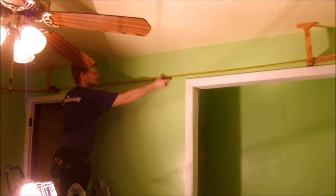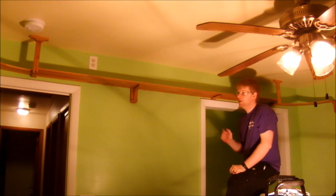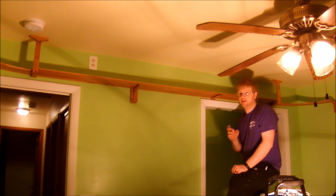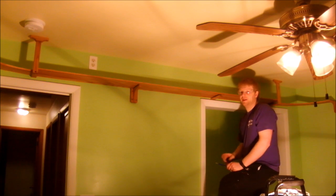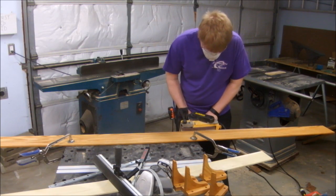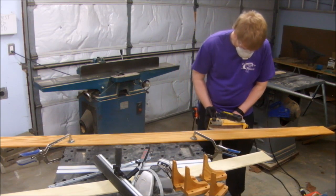Now with my corners in place, I can put my tape measure up and take an actual measurement of how long this straight piece needs to be. I can also mark out where I need my next support brackets to be. I'm running into a little bit of a problem — the board is straight but the wall has a little bit of a bow in it. It wasn't going to be a problem with those style brackets, but because I did the brackets going up to the ceiling, I need to trim the back side of the plank. The belt sander turned out to be the tool of choice because I can shave just the part that's touching the wall.